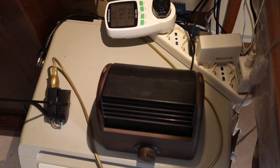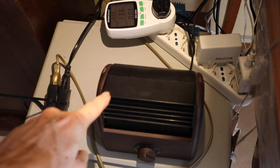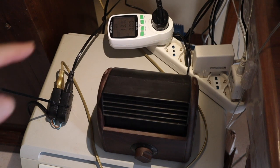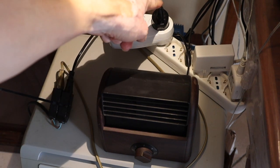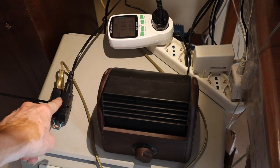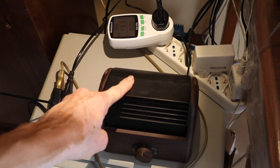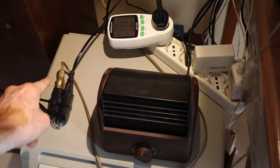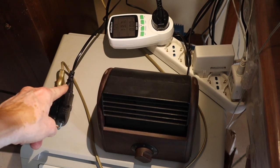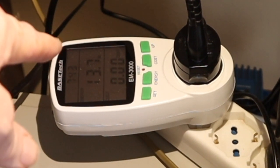Now compare with this. The combination of this fan and this lamp is working in series. The current from this meter is going to the combination of these two outlets. On the outlets are the ventilator — the fan — and the lamp. The current goes first through one and then through the other. The reading is 13.7 watts.